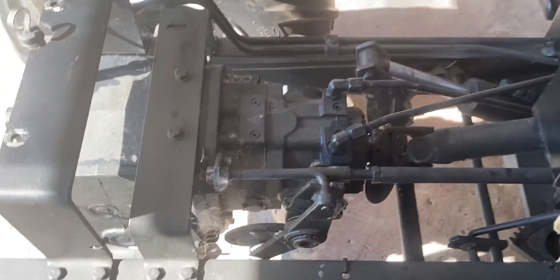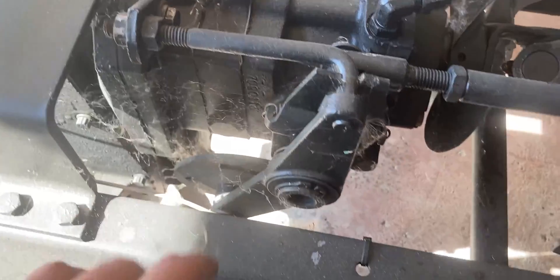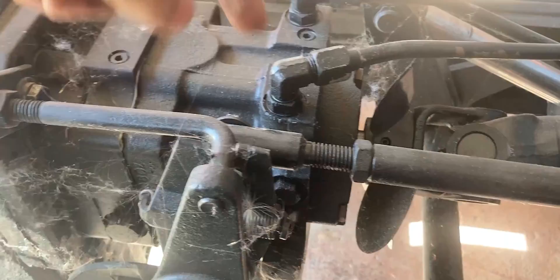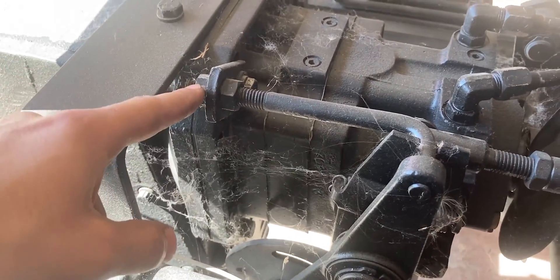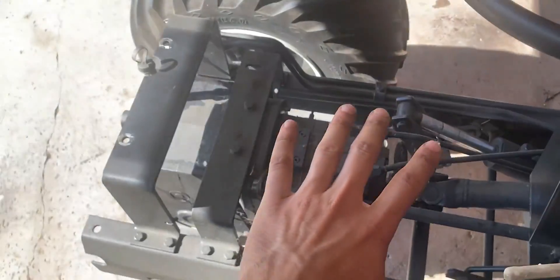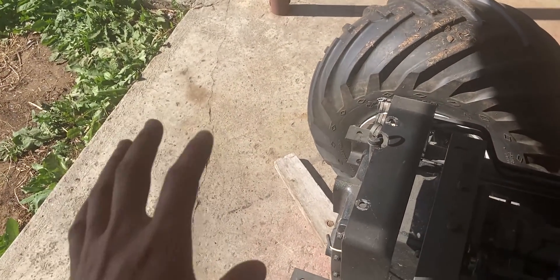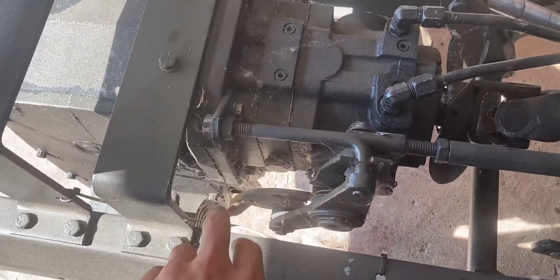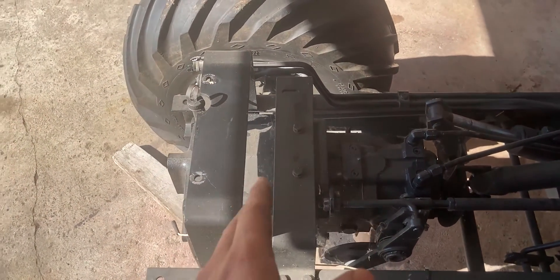If I come over to the other side I'm going to have to remove the linkage — I'll probably have to remove it somewhere here so we can remove the yoke. There's a whole bunch of spider webs here. I'm probably going to have to adjust or remove it here so this linkage will be free and we can slide out the whole rear end. Once the rear end is out I will remove the hydraulic motor itself — probably there are four bolts around the perimeter that are holding it to the differential, and we will get that all done today.